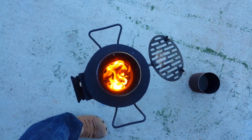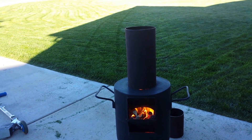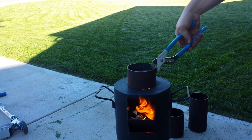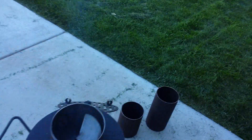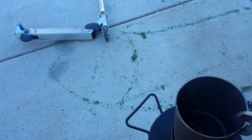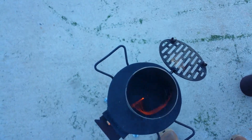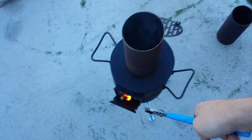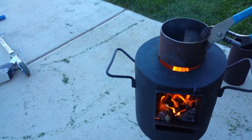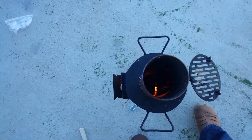That's before the vortex — using a 9-inch tube as a baseline. Now I'll do the 3-inch and 6-inch combo with the vortex insert. Step back — this is hot, don't touch this. Without much draft there is already a little vortex going on, so let's put 6 inches of pipe above that and increase the draw. That is better vortex action than I've seen. It does affect the overall draft though — I'm getting some pull-back, so I need to increase the angle of the vortex piece.